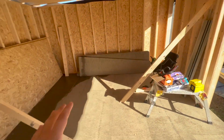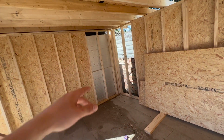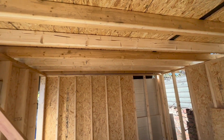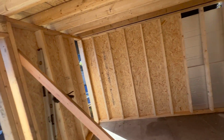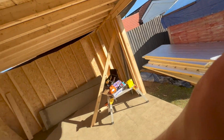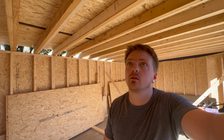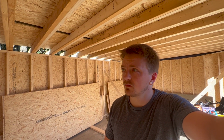Now I've got all this area, I can set up my circular saw and my chop saw. I can get those boards on, I can start doing all the noggins temporary, nog all the walls out. And yeah, just start cracking on. I might be able to insulate, I don't know yet, or I might wait till the roof deck is completely glued and screwed down.